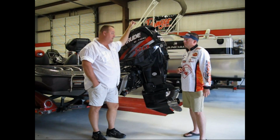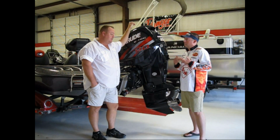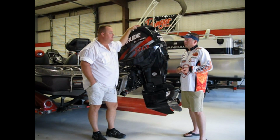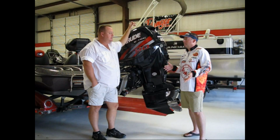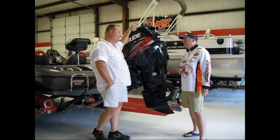Yeah, it's going to run for a while, but it's definitely doomed to quit on you. You get the vibration in there, and it's going to knock the seals out. You're going to lose your lube, then you're going to ingest water, and then the water's going to do the damage. So basically I can come in and get a $3 seal or maybe a few $100 prop shaft replaced, right? Or I can wait and then spend $5,000 or $6,000 to replace the whole lower unit. Exactly. It's cheaper to maintain them than repair them. Yeah.